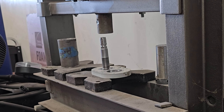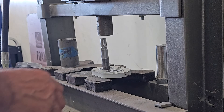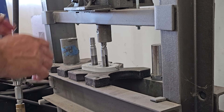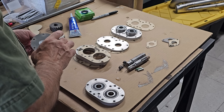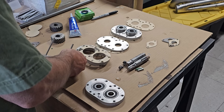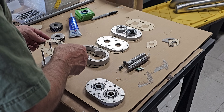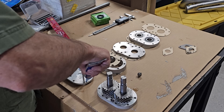We've got one plate here that's got some bearings in it. Our shafts are machined down just so that they can be pressed right into those bearings. Dual shafts running parallel — we're going to make our 180-degree turn back. That's what we're trying to achieve with this case. All these pieces are just going to be assembled kind of pancake fashion. I'm using stainless steel hardware — four-inch long bolts that we'll use not only for final assembly but to compress these plates together as we go along.